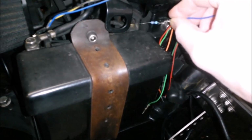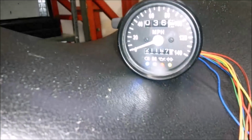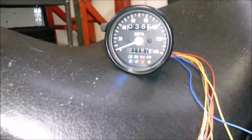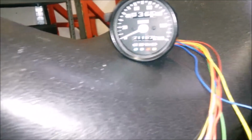We're going to go, let's just try the 300 first. Let's give that a razz. Just twisted the resistor around on there, pop it on. Well, it's quite a lot dimmer, isn't it, that one? Actually, I'll turn the torch off. I think yeah, I've got the torch on, haven't I? But I mean, even with that, you can see it's not half as bright.